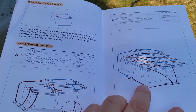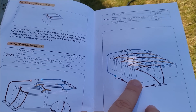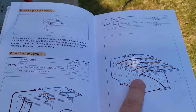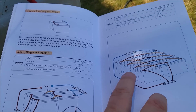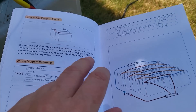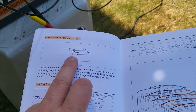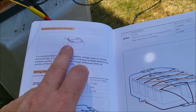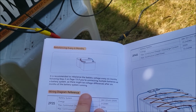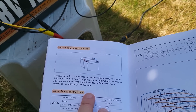If you put these batteries in series, you have to realise that they will gradually drift out of balance. Although the four cells within each battery are balanced with each other, the cells of one battery won't be balanced with cells of another. So the manual says every six months disconnect all your batteries, put them in parallel, and leave them for about 30 minutes.